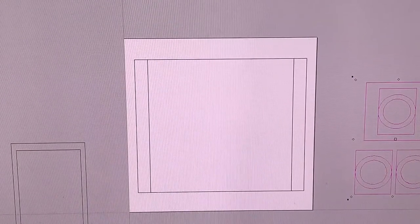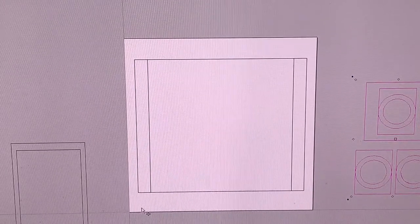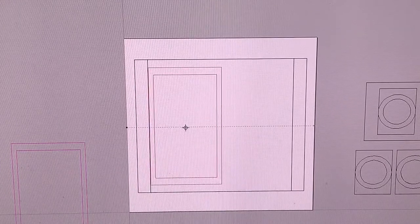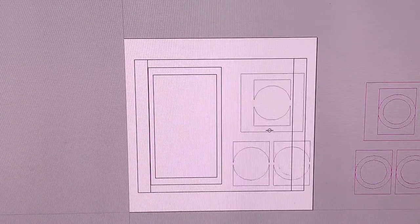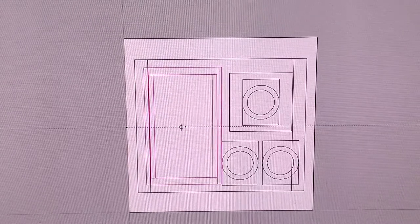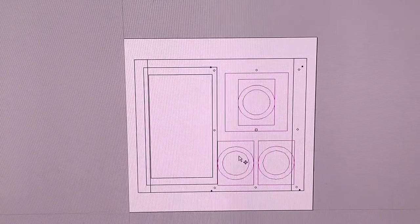This is Vectric Aspire, the software I use to design the models for my router. The white area here is the size of the outer box, which is 6x6. This inner square was the original hole, and the outer square is the new milled dimension - so this is what we have to work with. Over here I have drawn the control panel. The inner square is the panel cutout and the outer square is the bezel, viewed from the front. We've got the potentiometer and then the start and stop buttons. With the original hole we'd gain a little bit back with our bezel, but it just wasn't really going to work and I was running into where the screws were. So that was why I opted to enlarge the hole - it lets us get where we need to be and I think it'll look a lot nicer.